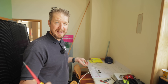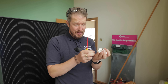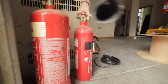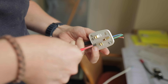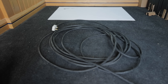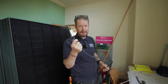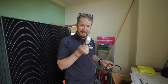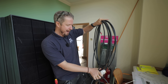Each optimizer will give us a reading from each panel so we can see the difference. Before we get stuck in, I'd like to know your predictions — do you think these broken panels are going to generate anything, or just not work at all? I need to grab the fire extinguisher just in case. First step: we've wired a 13-amp plug onto this rubber flex cable, which will carry power from the solar panels into our electrical installation and power up the inverter.